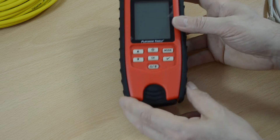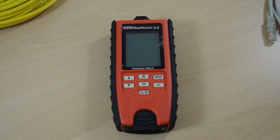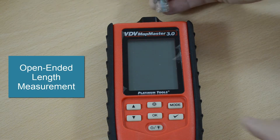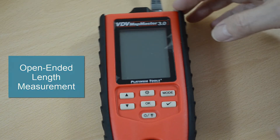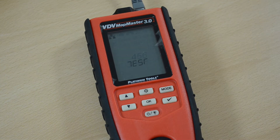So let's see what type of tests can be performed with this meter. I'm going to first of all do an open circuit test on a cable. This is useful for measuring length and very useful for measuring cable on a drum.